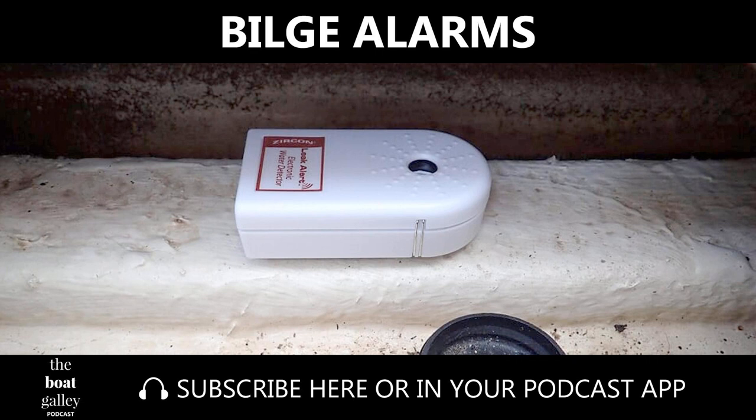You can do bilge alarms several different ways. You can wire it into the bilge pump circuit so that if the bilge pump goes on, the alarm will sound — that's what we had on our previous boat, but the problem is you don't hear anything until the bilge pump is on, which may not give you the early warning you really need. You can put it on a separate circuit with a float switch to trip it — fewer connections, fewer possible points of failure. You can also mount the float switch lower than the bilge pump float switch to get early warning. You can also use a separate battery-powered water alarm, which is easy to install but has less battery life and is not as loud as one wired into the house batteries.